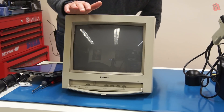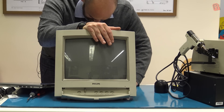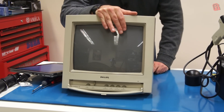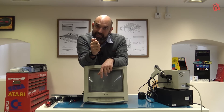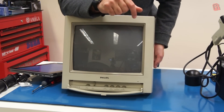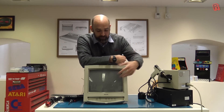So let me show you the symptoms. Here's our power lead — we're going to plug it in. If you're wearing headphones, this makes a high-pitched noise, so just be aware of that. Hopefully you heard that. It sounds like the falling bomb on one of those digital sound-effect key rings. That's exactly what it sounds like, so if you're having the same problem it should be very easy to identify. I also encountered another problem — I couldn't turn the thing off; it took four or five attempts to get the power button to pop out again. I have a replacement power switch here, so we'll change that too. But that's secondary to the main problem of that high-pitched noise and nothing appearing on the screen.